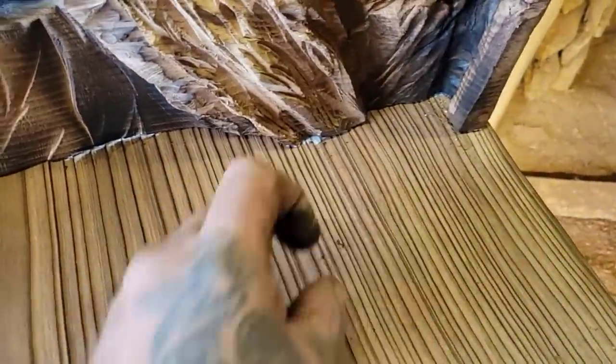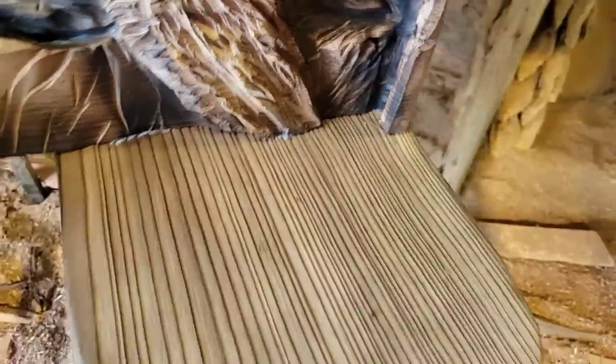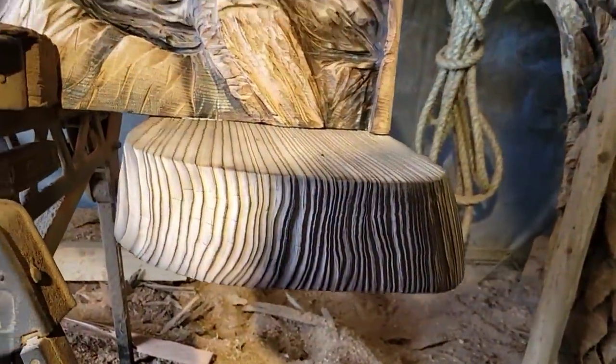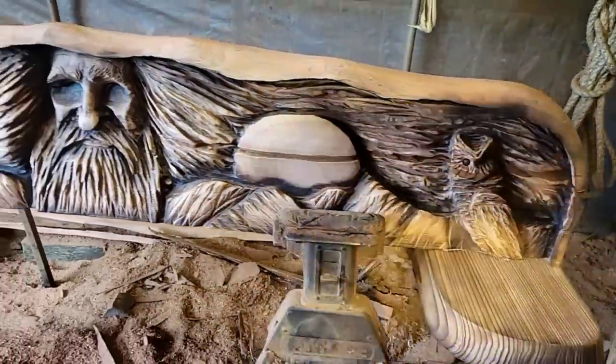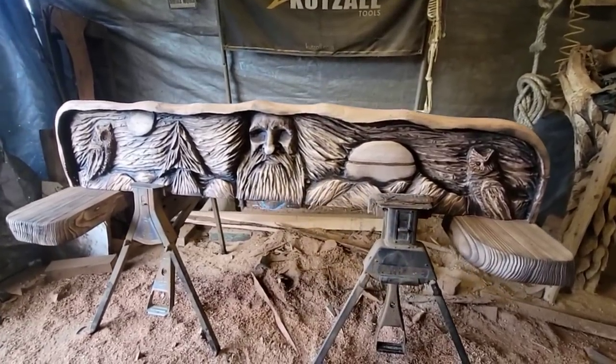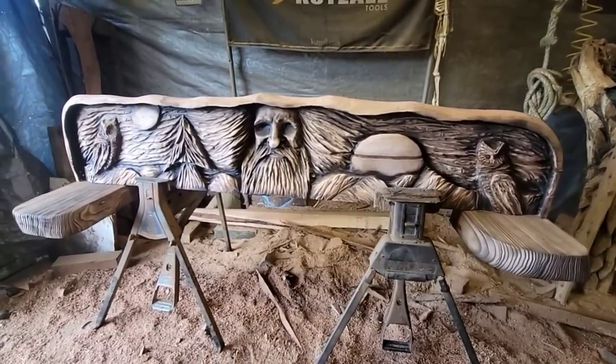A little bit of wood glue there. No big deal. But so yeah, when I had it flipped up this way, I went down through the headboard with like 9-inch or 10-inch timber screws that were a lot thicker, a lot bigger, and drove those pieces in there, and they're never coming off.